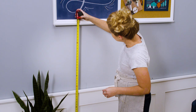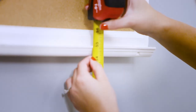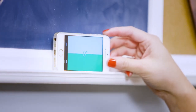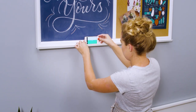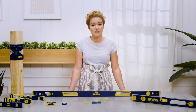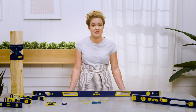In the case that you don't have a level when mounting something on a wall, you can measure up from the floor or down from the ceiling in several different places — assuming your ceiling or floor isn't obviously slanted. You can also use an app on your smartphone to find what's level. Keep in mind that neither of these substitutions is foolproof, and if it doesn't look level to you, it's probably because it isn't. As a homeowner or renter, a level is an indispensable tool for accuracy, whether you're mounting something on a wall or setting a post in your backyard.